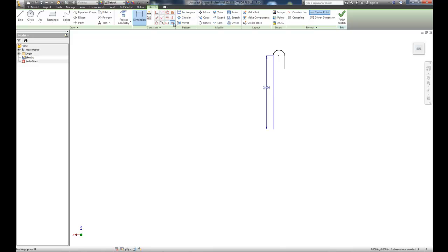We'll use the geometric constraints and apply the equal constraint to make these two elements equal. We'll also dimension across the two surfaces at 2.75 inches. So we've got a two inch by 2.75 inch profile dimensioned — that's our pathway we're going to use to extrude our shapes.